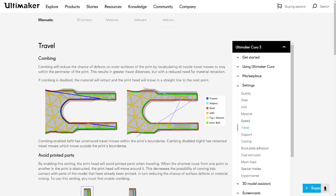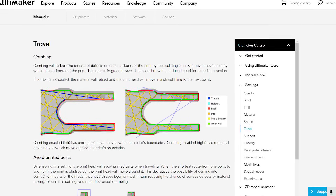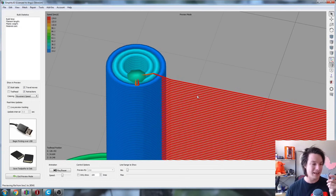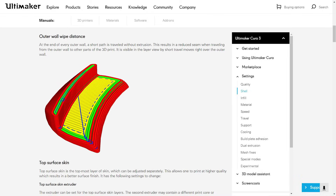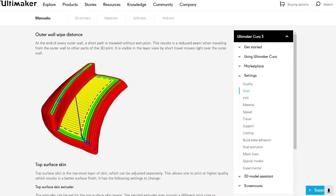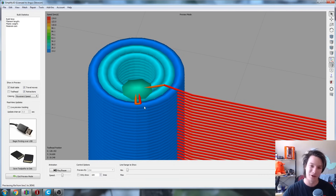And this is called combing, I believe, in Cura. But really, for this sort of test, it stops the stringing. The other tiny quirk in this G-code is this tiny line here. And that is the outer wall wipe distance, which again does help to hide the seam slightly and reduce that stringing. In my test, I turned it off and on. It's only 0.2 millimeters long. So in my test in Cura turning it off and on, I didn't see any visible difference. But this also will probably go into play if you have serious stringing issues. But it is the combing that actually seems to do the biggest difference.